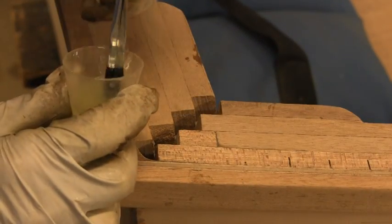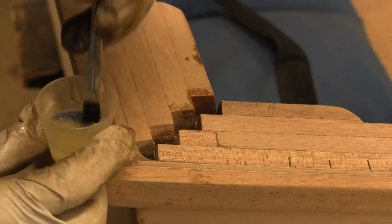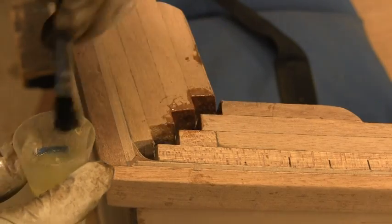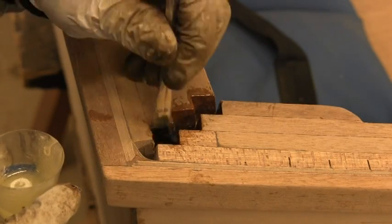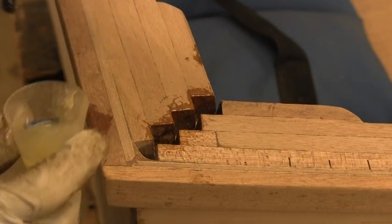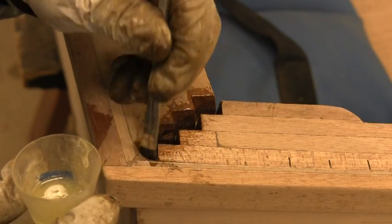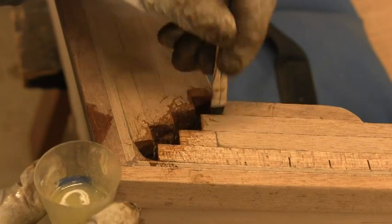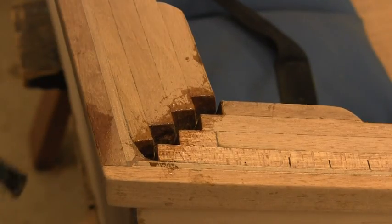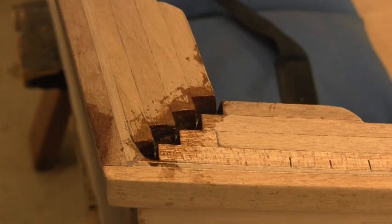One of the things I'm doing now is painting the straight mixed silver tip, painting the ends. I want them to, especially these end cut parts here, absorb epoxy so it doesn't dry out the EZ-Fillet when I stick it in next. Okay. We'll come back. This doesn't have to dry in order to do this next step.